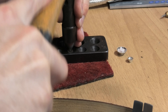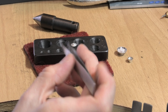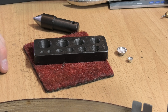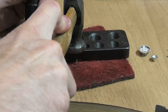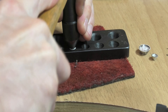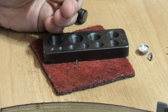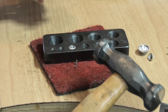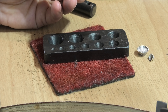I like no solder joins because it means you didn't have to do a solder - I don't like soldering. Also it's just nice to not have a join you've got to worry about, no little lines showing up when you're polishing and stuff - just a generally stronger thing. So I'm going to repeat what I did before, just keep annealing it and hopefully end up with a nicer collet this time. This one was fast - only my second anneal now and it's kind of finishing. There you go - it totally brutalizes that bottom hole, but this one's a much nicer shape. That'll do.